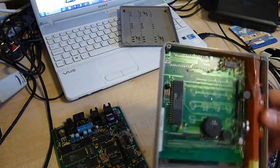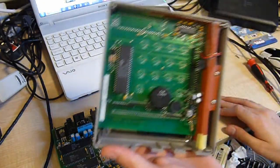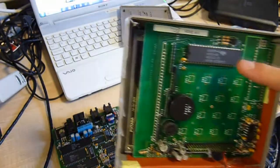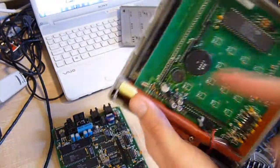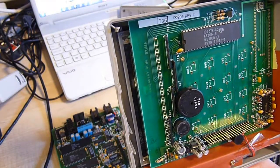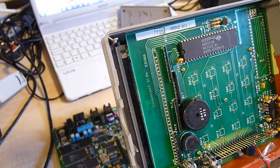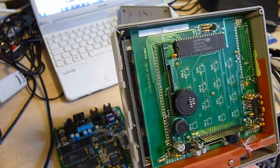On this end, we have the card reader circuitry, what looks to be some buffering circuitry and amplification goodness up here. I don't recognise the part number. Here we have what is obviously the display controller, and most importantly a VFD display controller made by Futaba, who are the world leaders in those things, and it is an unknown type, but you should be able to read the part number if you're watching in HD, and this particular chip is from 8939, so 1989, 39th week.